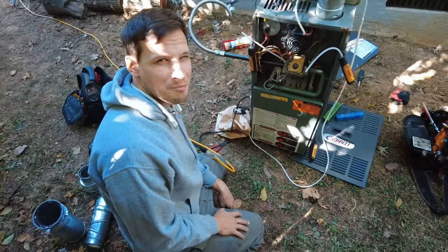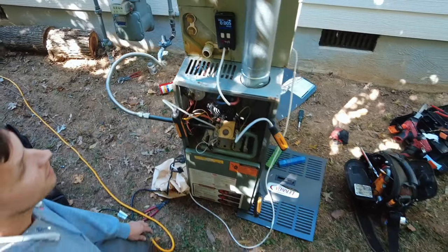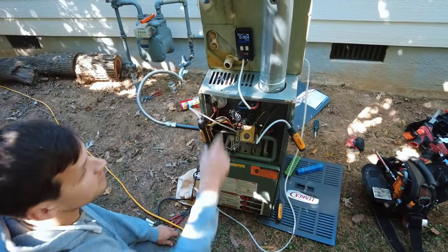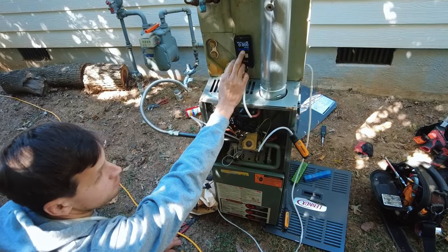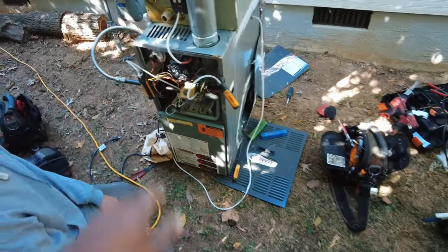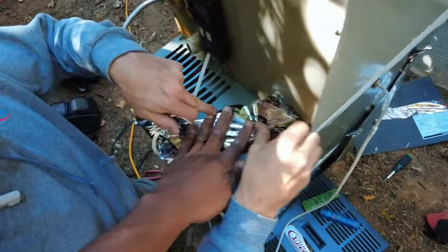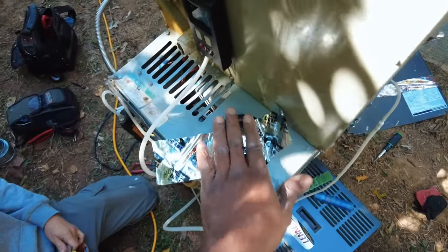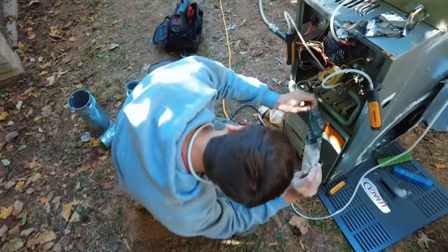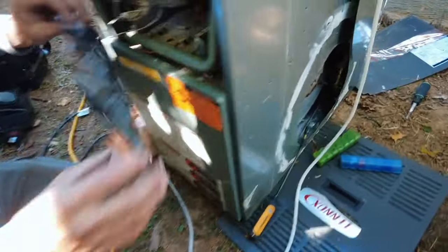Now we've got a mediocre-sized hole in there — let's fire it up and see if we see a change in CO from that 70 ppm baseline. We're seeing about five-thousandths of an inch of water column — that still wouldn't even round up on a normal manometer that only reads to hundredths. Now, do we want to plug up the stack inlet and see what that does before we put bigger holes in? The theory is: with the blower running and inducer off, the air should push through a cracked heat exchanger into the inducer. But there are already big holes for the flue pipe and heat exchanger that the small hole can't overcome.